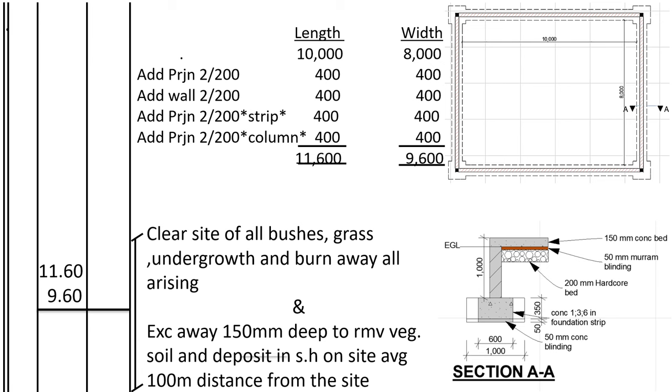Now we have the plan here. We are given 10,000 from inside the foundation spread to inside the foundation spread. So what area shall we do the site clearance on? The site clearance will be done on this area. I'm helping you mark using the red pen. We shall measure all that area that shall be used during excavation. My lines are not so straight, but you can see. The key point you should note is the column bases should be included